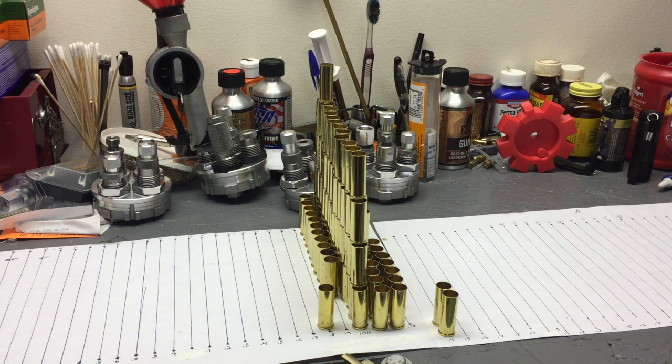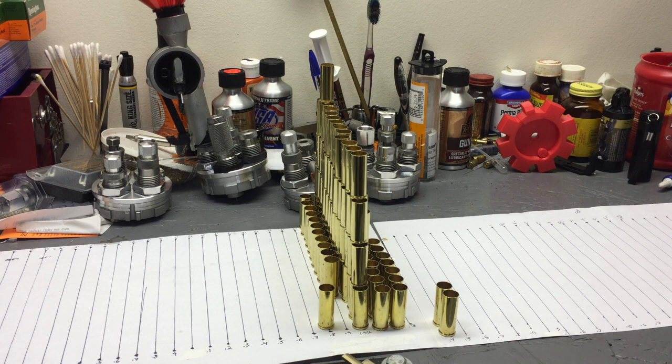Okay, wow. Lengthwise, man, the center almost stacked up to a pyramid. So what I do on this is I get my calipers, I grab one out of the group, I measure, and then I write that number down. The first one I pulled out was 1.376. So I wrote that on the table. I zeroed my calipers, and then anything plus or minus a thousandth went over. So these are the numbers. There's not a whole lot here, so I'll run through these.